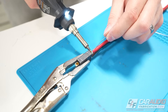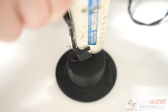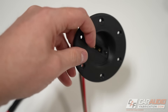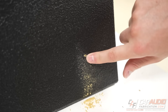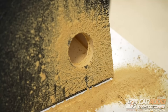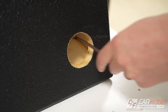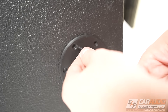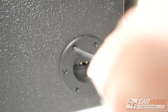I need to connect some speaker wiring to these plugs — check out my previous video to see that in more detail. I want to make sure there's no air leakage around the connector itself, so I'm using some hot glue to seal everything up. After allowing time for that to dry, the plug terminal is now ready for installation. I've drilled a small starter hole at the measured location for the center of my hole saw, then routed the wire inside the enclosure, making sure the plug is oriented pointing at a downward angle. I pre-drilled each of the mounting holes with a one-sixteenth inch drill bit and then added each of the number six fasteners.